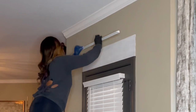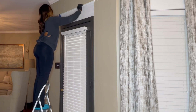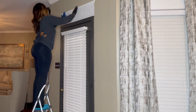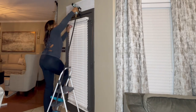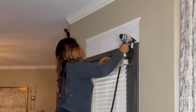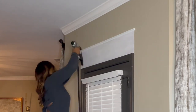I used my miter saw and just mitered the edges. We're going to apply the inside trim on the very lip of the board — it's resting on the board — and then I'll follow up with the nail gun using finishing nails. Anywhere that has nail holes, we'll just come back and fill with wood filler.